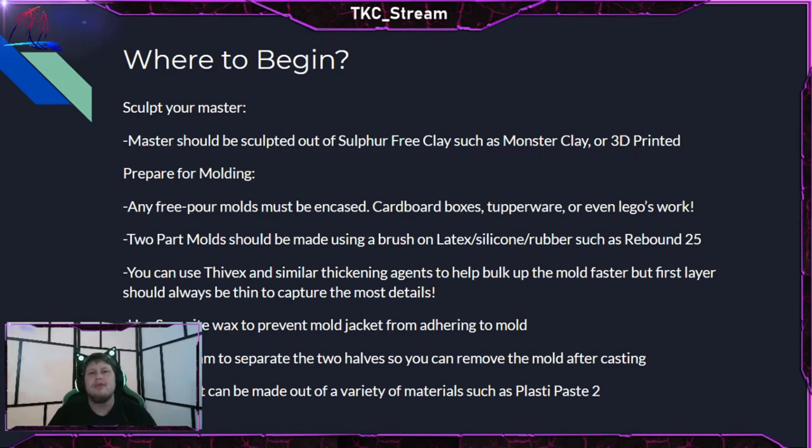The one I typically use these days is the Smooth-On Universal Mold Release. It's also good because it is a spray, versus the W94 whatever it's called, which you actually have to brush into the mold. So that requires a little bit of actual preparation, whereas with the spray one, you just spray it, wait 30 seconds, and then you can start using your mold right away, or casting.